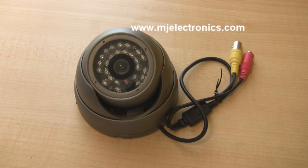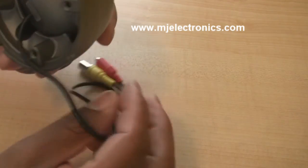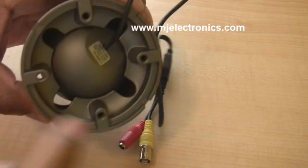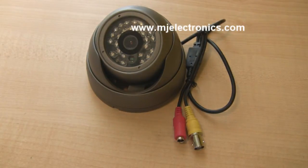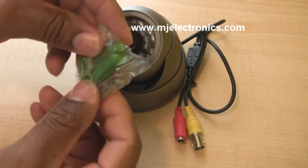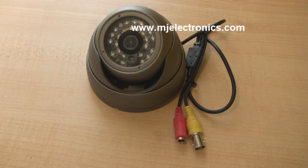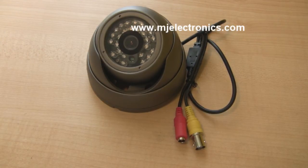It's a one-third Sony CCD chipset, 620 TV lines of resolution, zero lux with the infrared LEDs on. It's a day and night function camera and it's very easy to mount. You basically just use four holes — it comes with screws, plastic anchors, and an allen key for adjustment. It's a 12 volt camera. Look below in the description for more specs and information on the camera.